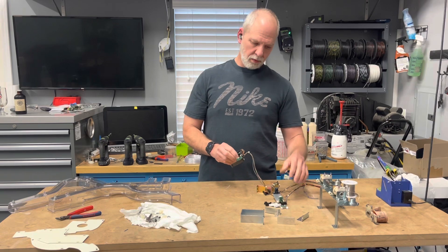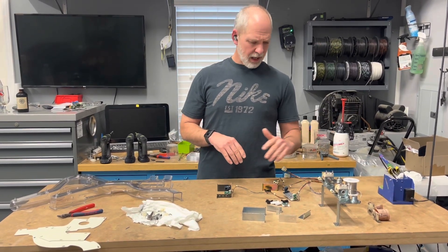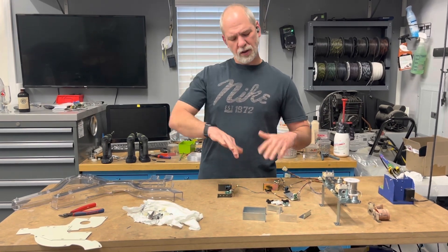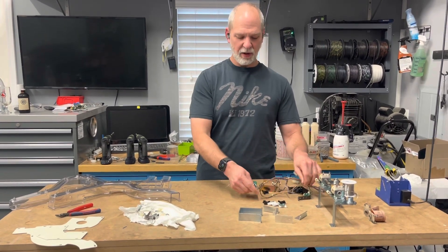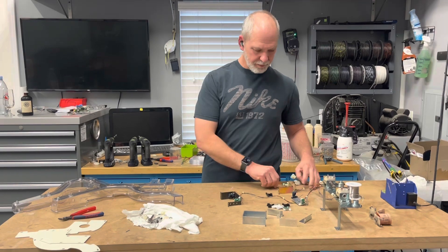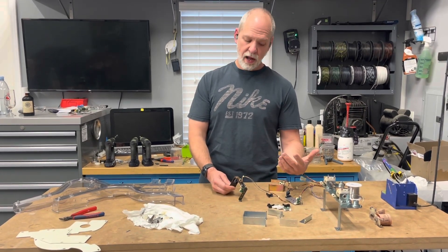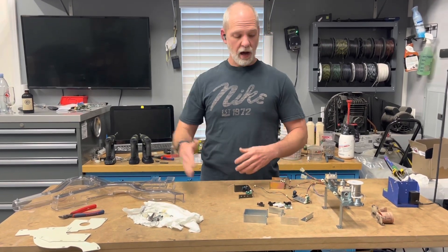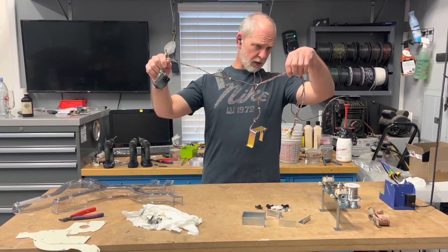The next thing I'm going to do is start replacing each opto one at a time. I don't want to just cut them all free and go that way, because sometimes they get turned kind of funny — next thing you know you've got this going this way and that going that way. I'm just going to take one opto off, solder the new one in, then take the next one off, solder it in, and do that until I've gone through this whole chain through the whole harness.